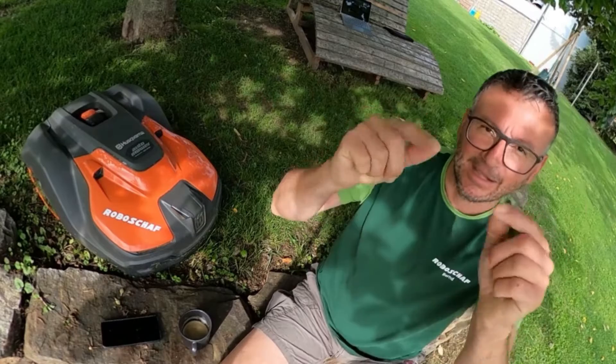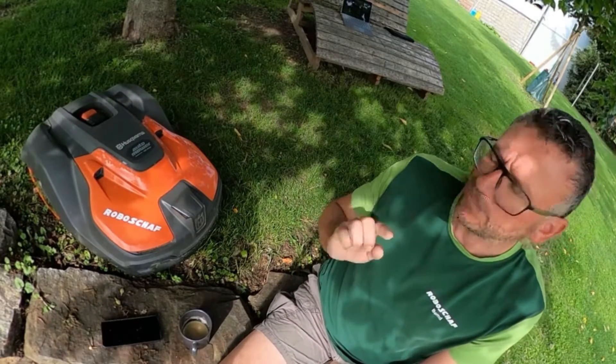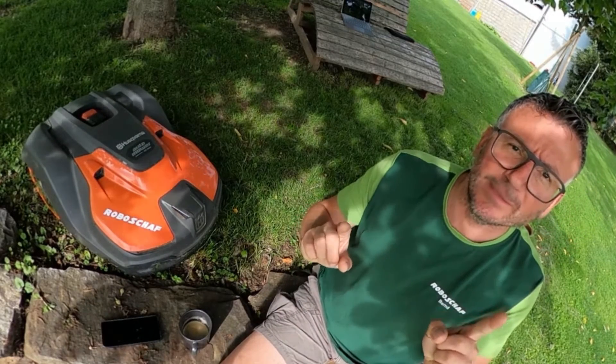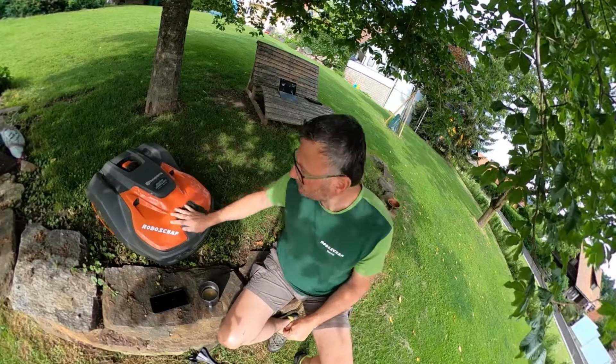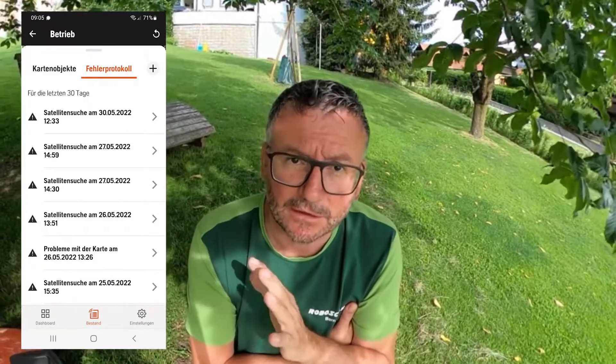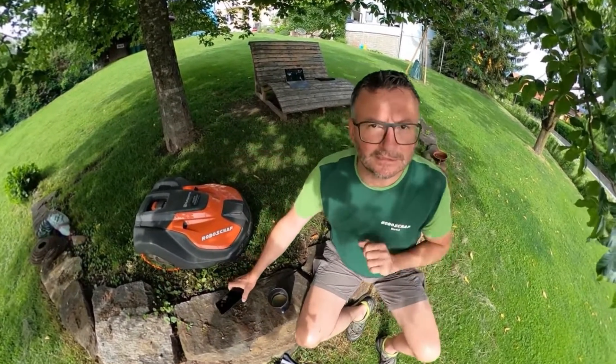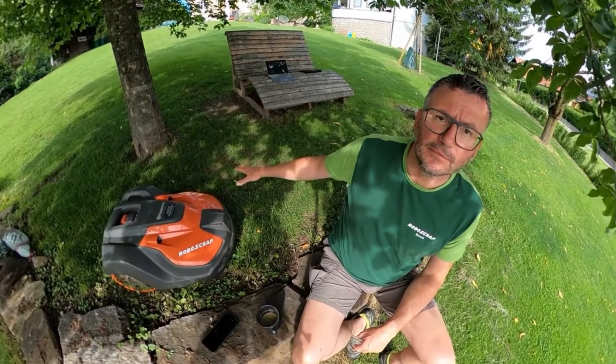The lawn robot standard states that the robot is not permitted to operate unless it has precise knowledge of its location within a two-centimetre range, and this requirement is doubly redundant — he always has to know it. Now let's take a look at the tree. We see nothing from the sky there. That means it's a spot that is not easy to handle with RTK. And it's not just a quick satellite search, as you hear in some videos, and he'll eventually continue driving — no, he will not continue driving in there. If we do not specifically pay attention to what we are supposed to do, which includes actually evaluating and measuring satellite reception everywhere in these areas, he will end up stuck in the corner.